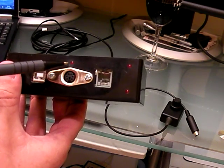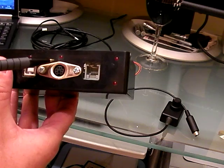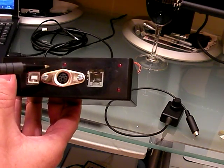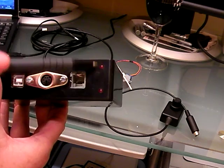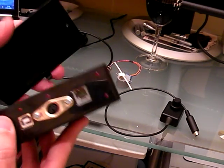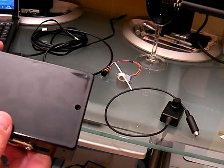There's an LED above the USB socket indicating status — whether it's connected or disconnected. There's an LED above the manual control socket which indicates whether you're in manual focus mode or rate change mode, so you can change the rate the manual focus applies. Then there are two LEDs on the end which indicate whether you're focusing in or out.